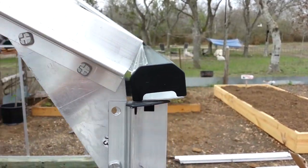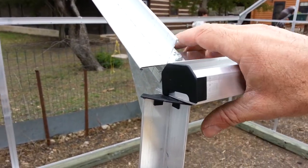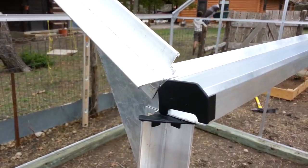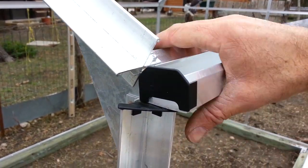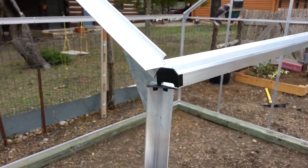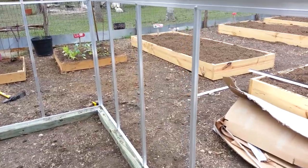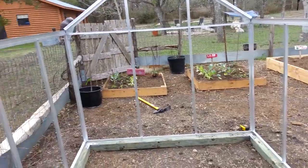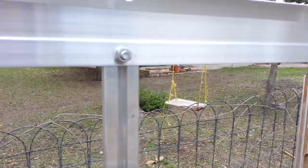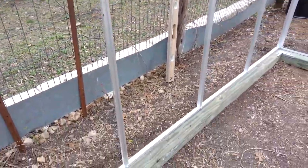The plastic gutter ends were then put in place. I noticed that because it's not all together exactly yet, the aluminum still shifts and bends, meaning the plastic needed the gutters forced back together to get the plastic to fit — that should be better when it's all together. The vertical side studs were then installed the same way as the back stud, where you actually have to slide the bolt into the stud itself. Everything right now is just hand tight.